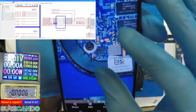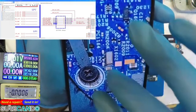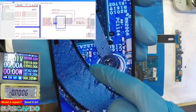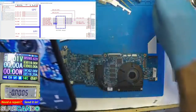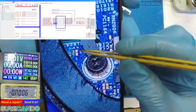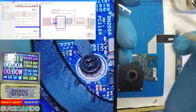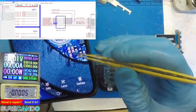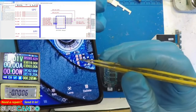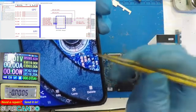When I took this photo to show him that this is what I'm measuring, that's my soldering afterwards, I noticed that this is actually just two pads. They're actually connected. This acts as a 0 ohms resistor. So manufacturers are being lazy now. They're just doing this. They're not putting a pad, not putting a resistor, say, when manufacturing.